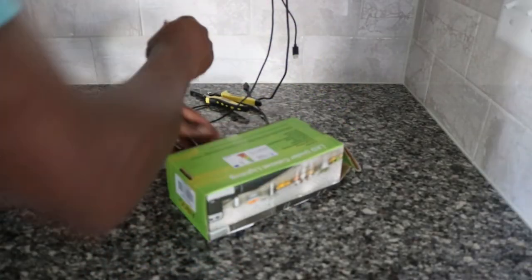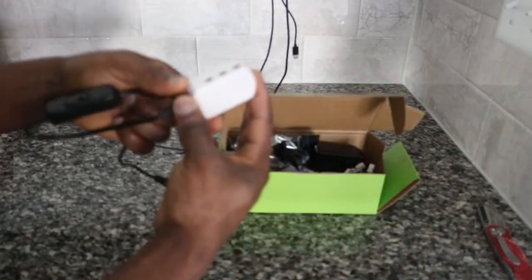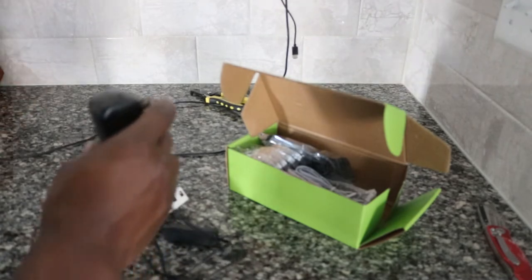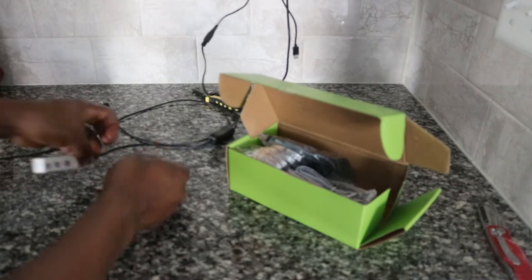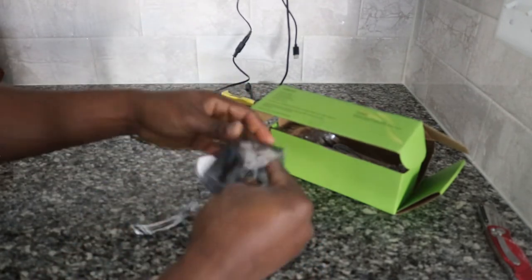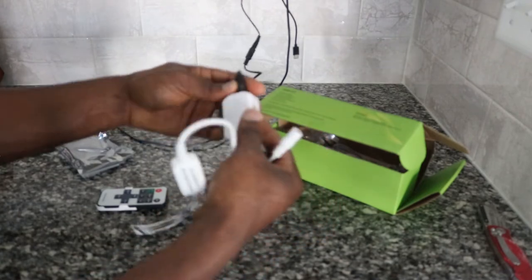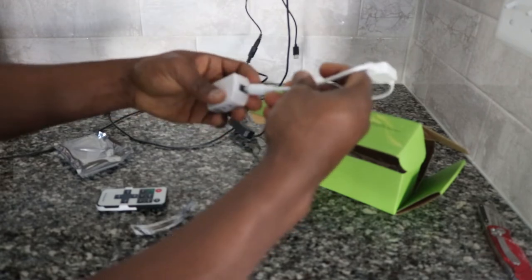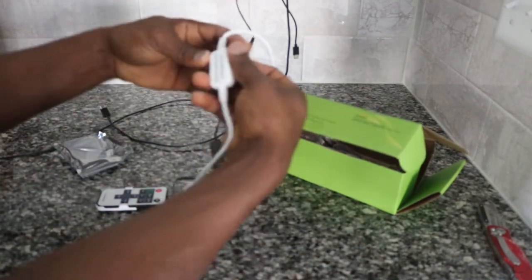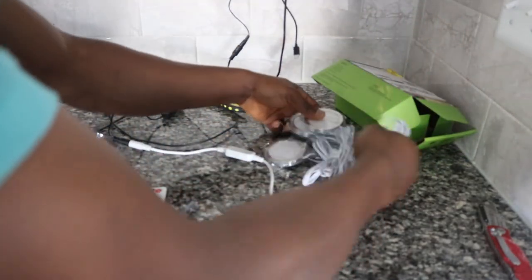This is the light that I got from Amazon. Let's open it so you can see what came in the box. The first thing is the switch — this is a switch to make all the connections. It came with six lights. Once you connect this to the power supply, you have the switch here to turn it on and off. In the back you have the remote control. You can remove the plastic and use the remote control — you unplug this, connect it here, and then connect this connector back to the switch. Power comes in, traverses the LED controller that is managed by the remote, and then all the lights are connected on this switch.